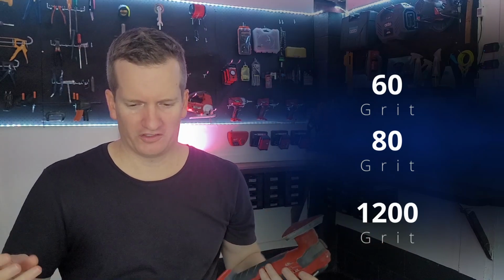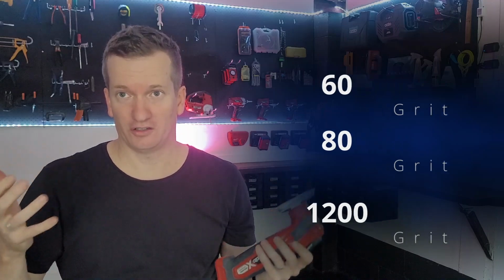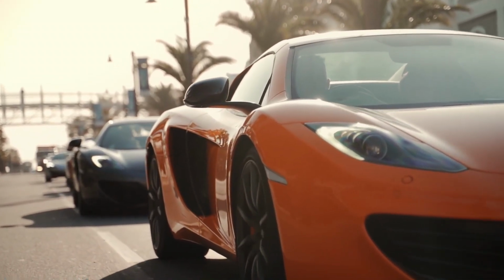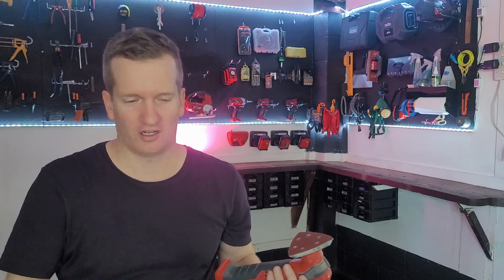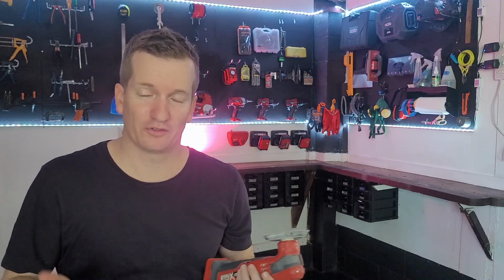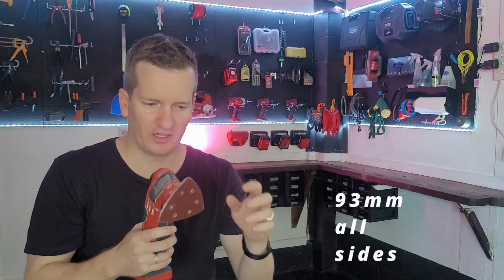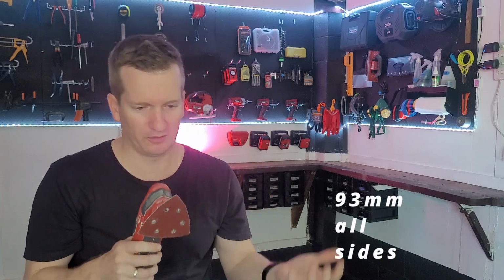However, if you're working on, say, something like restoring a vehicle's car headlight, and by the way, I don't think anyone should be DIYing that, that should only be a professional task, but say hypothetically you were doing that task, well, in that case, you would be using a 1200 grit sandpaper, or potentially even something higher, to restore the car headlight. And so for me personally, for projects around the house, I've never needed to go above 150 grit sandpaper.